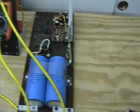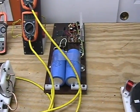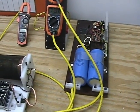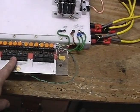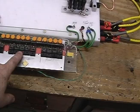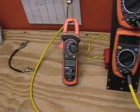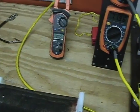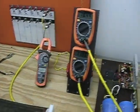I always put circuit breakers on all this stuff — it's best to err on the side of caution. If you have a catastrophic short while you're working, or you blow one of these chips, you have a dead short. If you burn out the chip inside, most of the time it is a dead short, so on your amp meter it'll just start climbing like crazy. That's going to get hot and start melting stuff, so you've got to be careful.